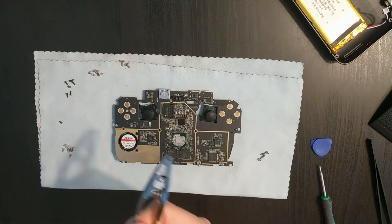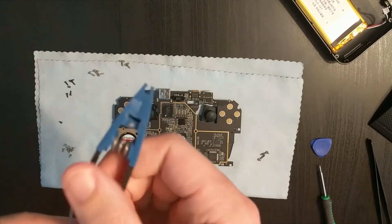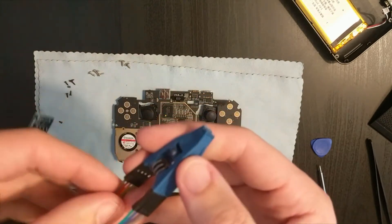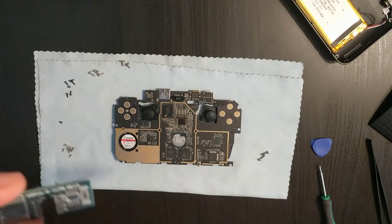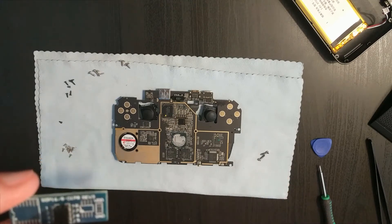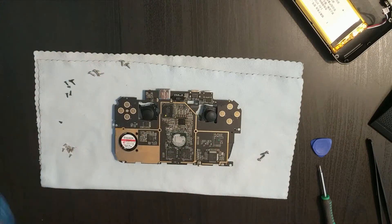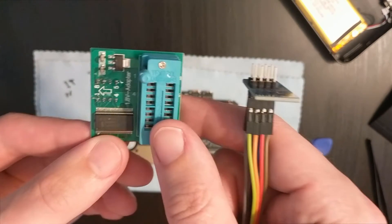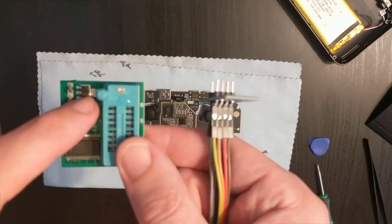Here's where you're going to need one of these clips — the one I bought is listed in the description below. There are cheaper models, but I found they are not very effective. You'll also need to get some wire. The other thing you'll need is a little converter board, which actually comes with the clip so you don't have to buy that separately. You'll also want to get a 1.8 volt adapter — I've heard of some being able to flash the BIOS without it, but I didn't want to risk frying the board.